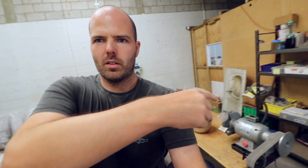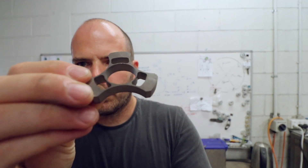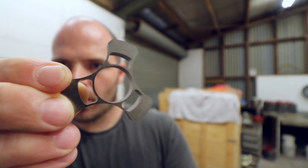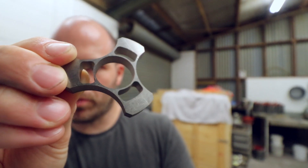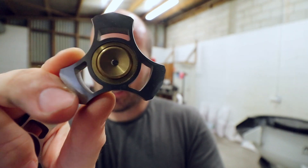Right, so there we go — we have it cut. It's very loud here, both because of the equipment and stuff going on outside, so I think we will discuss this back at the old workshop. Okay, so old workshop where the grinder is, so we can make this beast nice and smooth. There it is — very thin. You can see it's really thin around the core, about one millimeter, and up these legs here that's one millimeter as well. The whole thing is very light. The core I'm going to put in is this brass core that's already in the old design — so that'll add some weight to it.